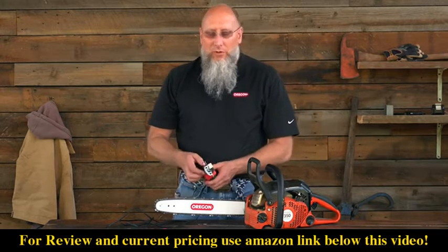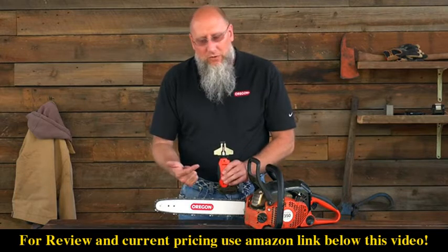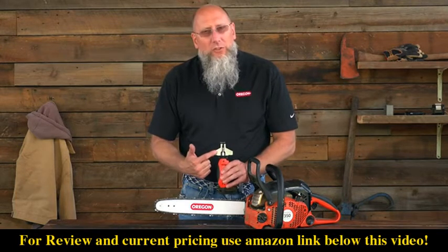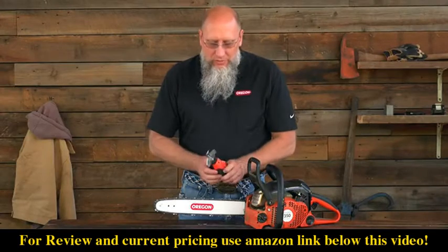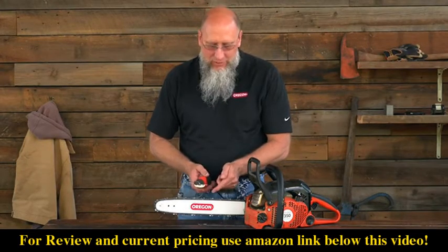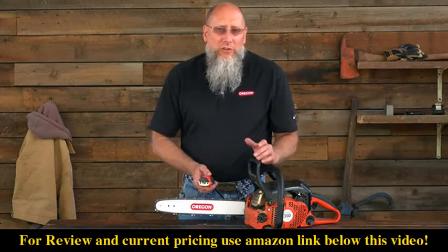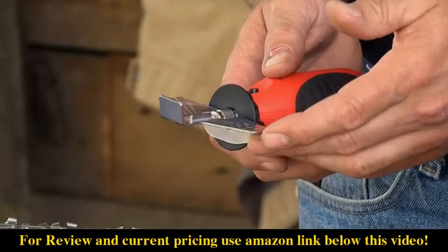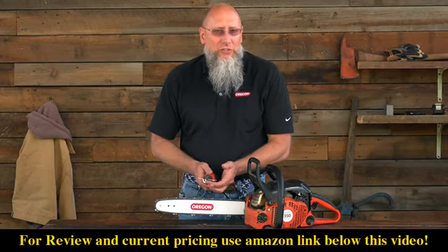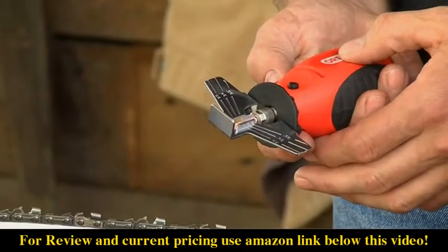In our particular example, we're going to use the car battery adapter, so I'm going to plug that in and power it up right now. With power supplied, you'll notice that there are angles marked on this plate — 25, 30, and 35. You want to line up that line with the chassis of the chain, and that will give you the correct angle for your top plate. When you're grinding, you don't want to hold the stone in one location — you actually want to work the tool back and forth along that cutter. That'll even the wear on the stone as well as help avoid creating a hot spot on that cutter. So I'm going to go ahead and turn this on and grind some cutters.